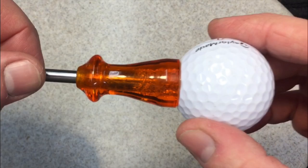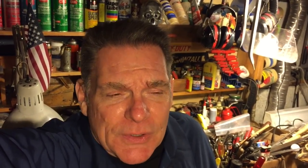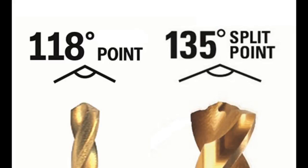I just wanted to first off thank you for all your help on the last video when I was asking for your help about my crazing acrylics — the acrylics for making the screwdriver — and the epoxy. We had so many great comments and a great back-and-forth discussion. One of the things I did was order some different drill bits, because drill bits usually come in two common angles considered general purpose: 118 degrees and 135 degrees.